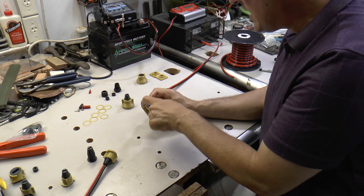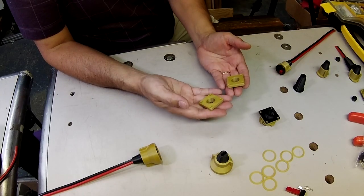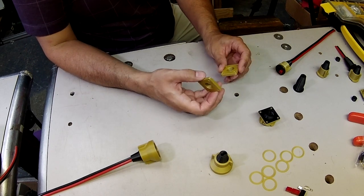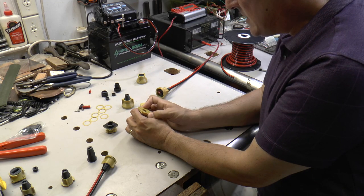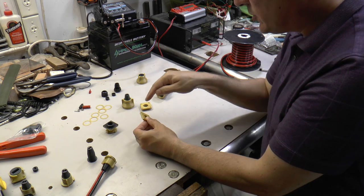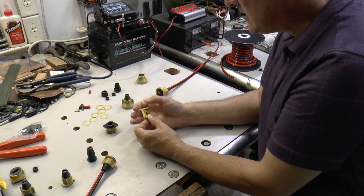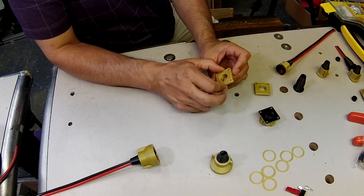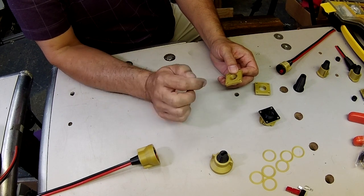And to make sure that you've got the right hole pattern, I made a couple of tools. I've got two versions, one that has bigger holes and one that has smaller holes. These ones are designed so that if you use the one with the bigger holes, it will drop down into the hole, and then you can match drill through this tool with a drill bit that will then allow you to install a 4mm stainless socket head cap screw in there. And this one has holes that are the right size, that is the tap drill for an M4 thread.